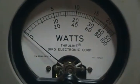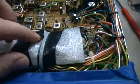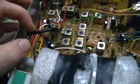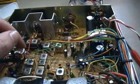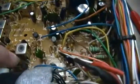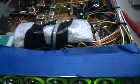Alright, hang on. Alright, JW, your NightHawk's all done. I just got to put the covers on, remove the tape. Connex board came from the Galaxy 2. I still don't have any mounting hardware, so just the usual zip tie to the front harness there. We got your super modulator install. We've got the MOSFET upgrade, your 3 filtering caps, did the wide receive hi-fi audio, and super sensitivity receive here, your noise blanker, and those blue dials down there for your AM detection. It's been realigned.